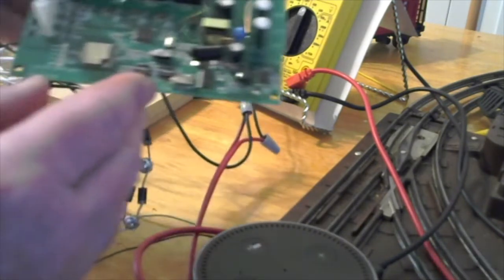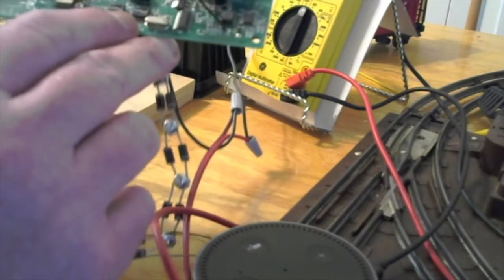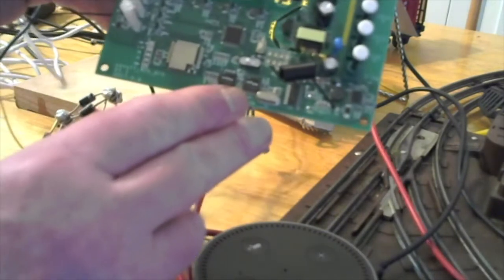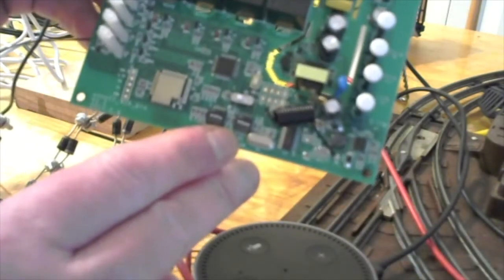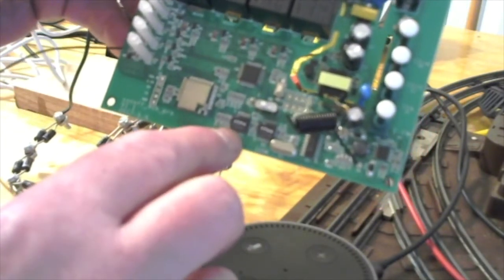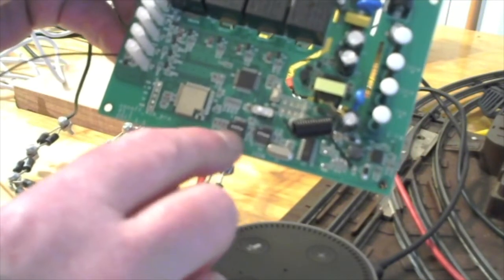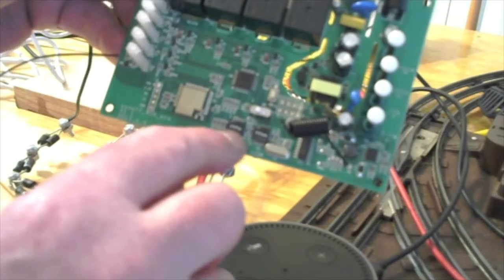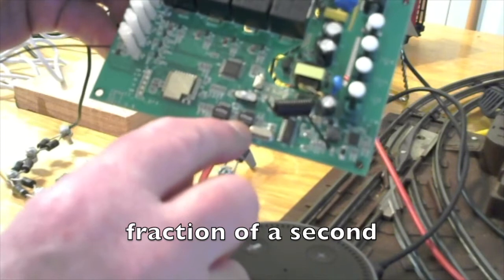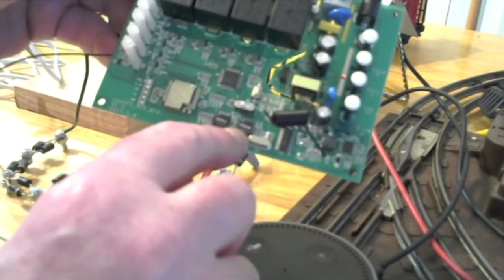And these little dip switches right here, they have to be set in this configuration here, and I'll do a little diagram. I don't know if that's going to be in focus with the webcam, but let me see on mine. This particular set of dip switches sets the momentary mode to how many seconds it's on, and this sets the two to self-locking or latching, and the other two to momentary.